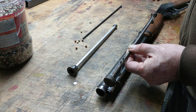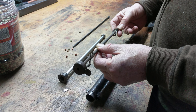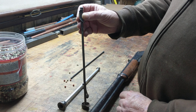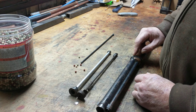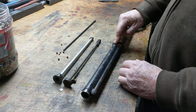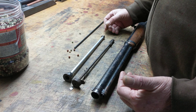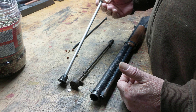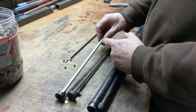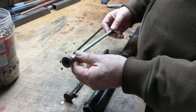This is the shot tube that came in this particular Daisy 111B, and it's pretty standard for a bottle cap Daisy. It has a 7/16ths 14-tooth thread that threads into the abutment washer on the gun, which is located in here, and we can't see it because it's under steel. So to build an Airsoft tube, all you really need to do is fabricate a new abutment — a device that will fit the abutment washer — provide yourself with an Airsoft barrel, and then fabricate an end cap, which we've done.